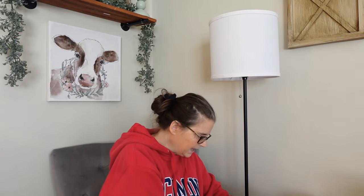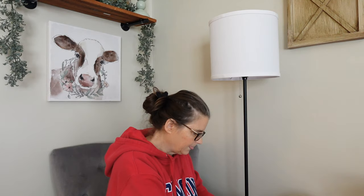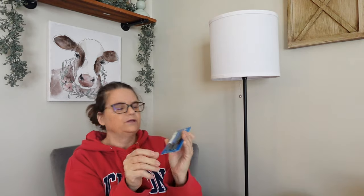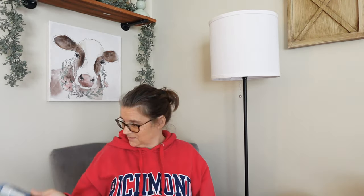Then I got a punch nail set kit. So what you do is you just take this end and you tap it on the nail head, and that just puts that nail just a little bit below the surface. Take a little dab, fill it in, sand it, get it smooth. Can't even tell there was a nail there. Guess how many of these baseboards I have to do that? All of them. Also have to patch where they joined two of them and didn't caulk, didn't do anything, just left it.